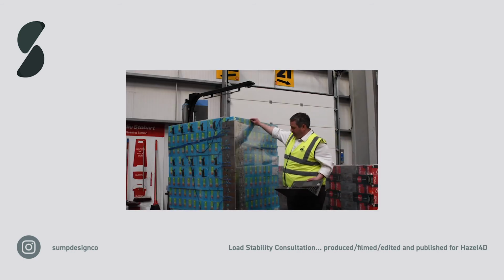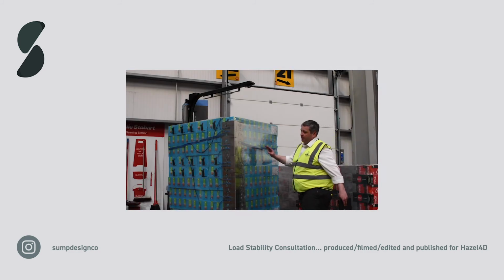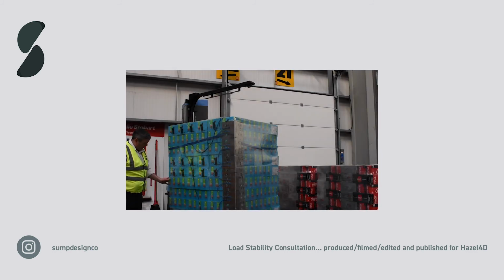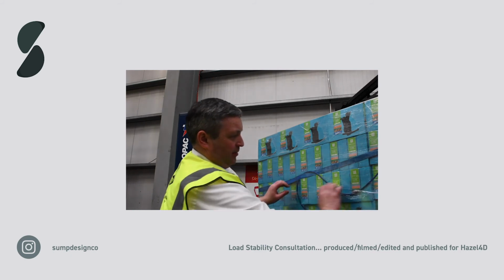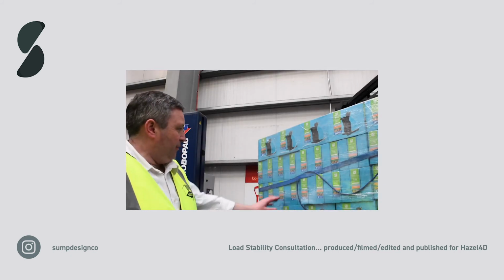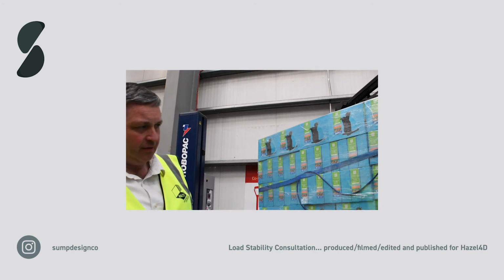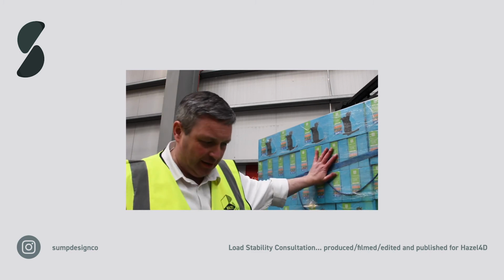You look at the clarity, the film's there, but what you will notice is we're not going to have the same corner pressure on the product that you've got currently. See that we've got a nice tight wrap around it, but it's not crushing the boxes at all. Let's have a look and see where the film is. There you go. That's the zone that we want to be in with what's left in the film, just a little bit to allow for your discrepancies on the corner. A good bit of tension there. That pallet's not going to go anywhere.